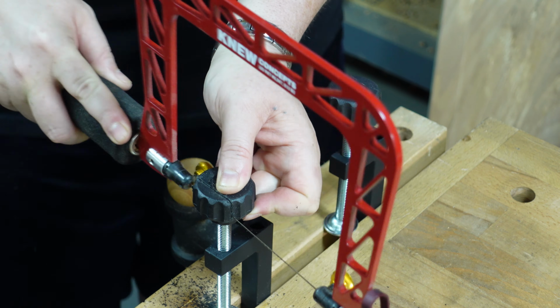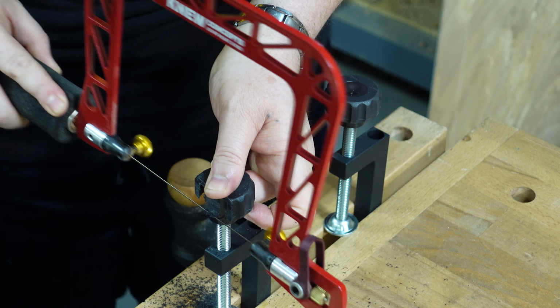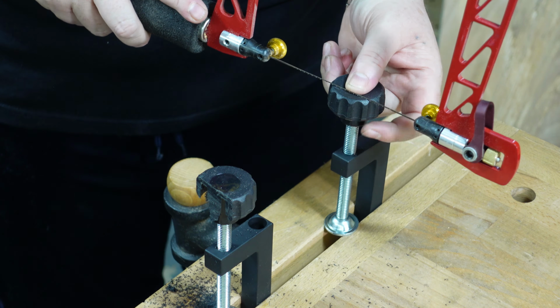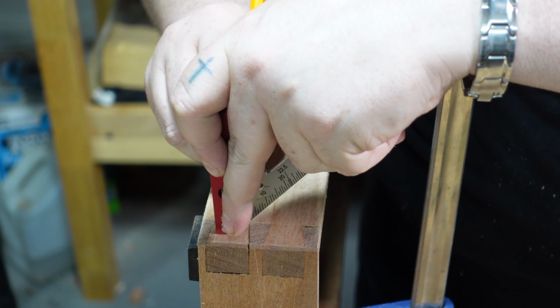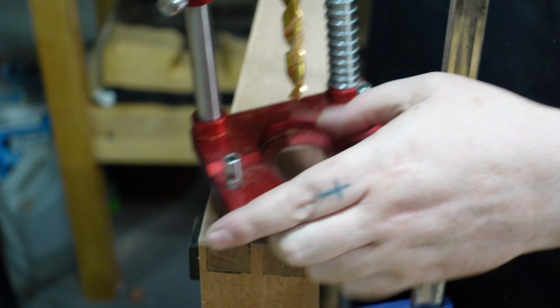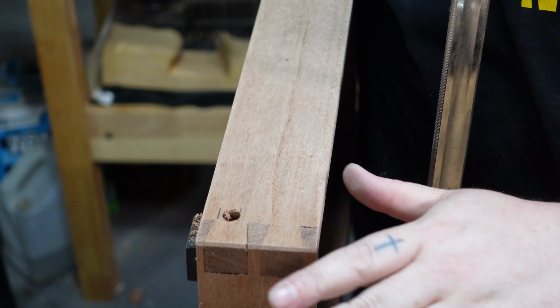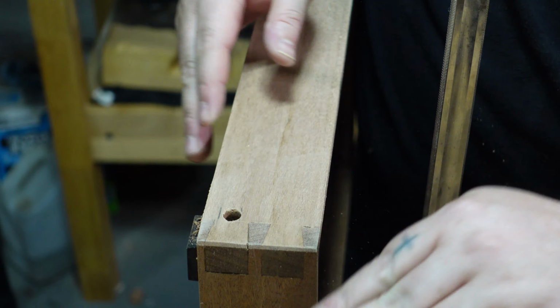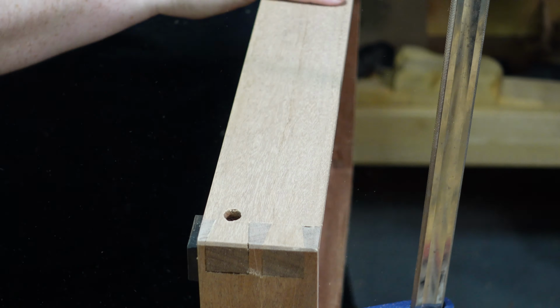The clamps that hold this chest onto a table are just fence clamps, and I needed to cut the handles down so they would fit underneath the workbench. I then went around the sides of the box and drilled holes right above the feet, so that when you clamp, the clamping pressure is going against the foot of the workbench and not leaving an air gap between the chest and whatever table you have it clamped to.